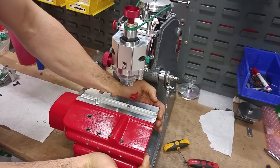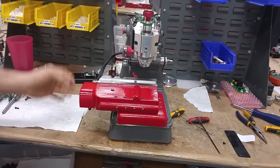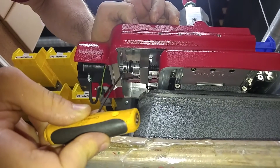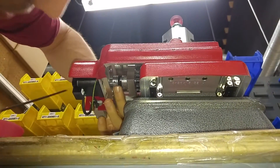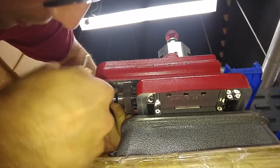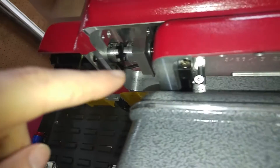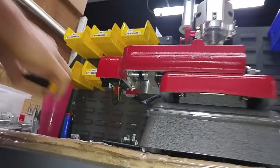We're going to slowly pull the table over a little bit. Now we're going to unhook the coupling that attaches this stepper motor to the ball screw on the inside. We're going to do that with that same 3/32 Allen wrench, loosening this screw here on the left side — not this one, do not touch this one — it's going to be this one on this side. You can turn this with your finger to expose that screw as you need it. Loosen that screw up, and using your tool push it over, unhook that coupling from the other, which gives us freer range of the table. The coupler slides back along that motor shaft and becomes disengaged with the ball screw.